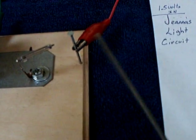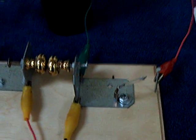I'm using a xenon flash bulb out of a disposable flash camera and a spark gap to show you this thing jump. That is many thousands of volts coming out of one AA 1.5 volt battery — that's all it is. I'm bumping 1.5 volts up to many thousands of volts right there and jumping that spark gap. Very similar to a Tesla coil circuit. But very interesting to play with, as long as you're careful. And that's my mini lightning maker right there — I don't know exactly how many thousand volts that is, but that's a lot of voltage to jump that air gap.